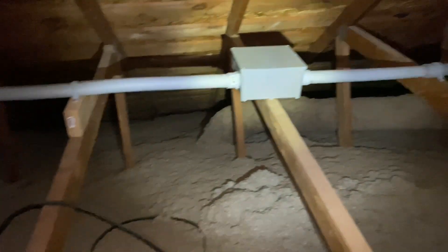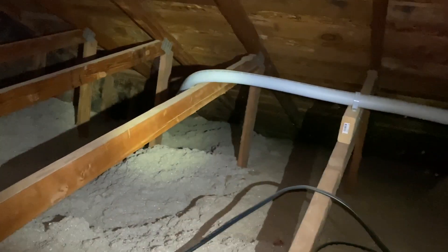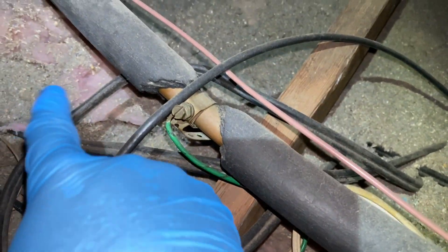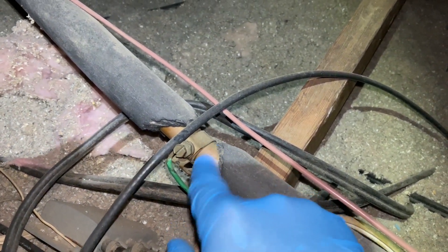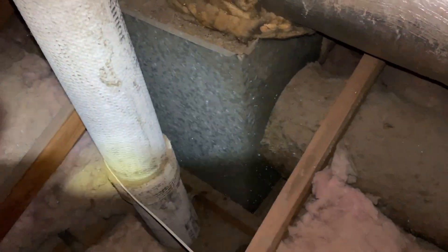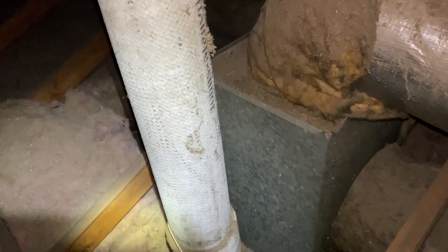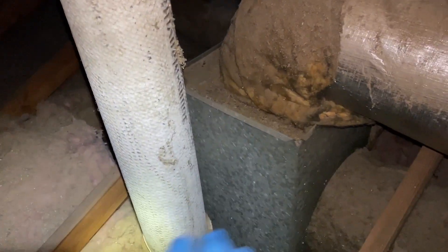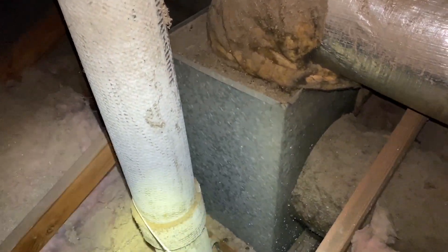We're in the attic now — here's our line set and there's a junction box. Here are the ducts. Love how the cable guys grounded the cable to the refrigerant lines — we'll probably get a little drip right there. Back at the plenum: that transite flue pipe is fine for a natural draft furnace, but when you put in one with an inducer, the exhaust isn't hot enough so it condensates and runs down, producing all that white residue that gets inside the system.